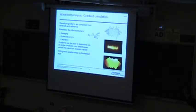And then you can use conventional things like a shear plate in order to set the collimation. Actually, what I do more recently is I take the lens out, and I just look at the bare fiber, and now I've got a spherical wave with a 0.5 meter, or maybe I'll set it further back, a meter radius of curvature. And there's no optics in between. I just have a single point source. Now there is possibly air in between, and any little turbulence in the air will give me a bias. But I just put a fan next to it, stir up the air, and then average for 1,000 frames or something. By the time I've averaged those 1,000 frames, I have a very good estimate of where the center of those focal spots is.